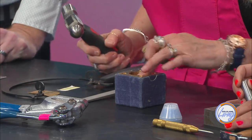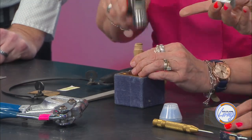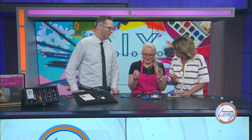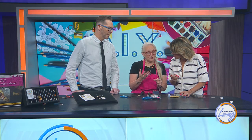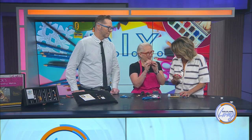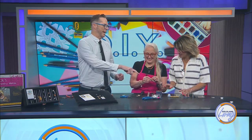Then I can put it in a depression in this bronze block made for this purpose. It's important not to do metal to metal — this is a previously used piece of copper that has some cute little flowers already stamped into it. If I want to preserve them, I need to make sure not to do metal to metal, because that will really flatten and obliterate them. I use an old peg — I pull them out on purpose so I have just the right shape.